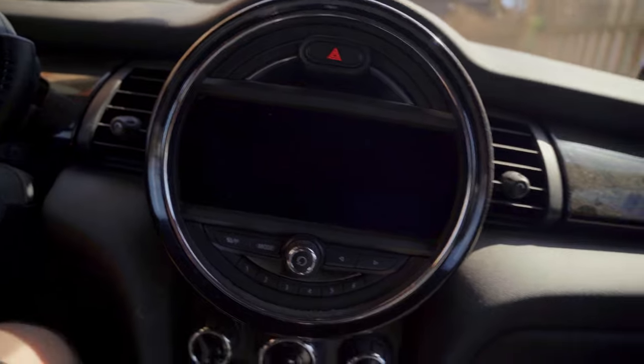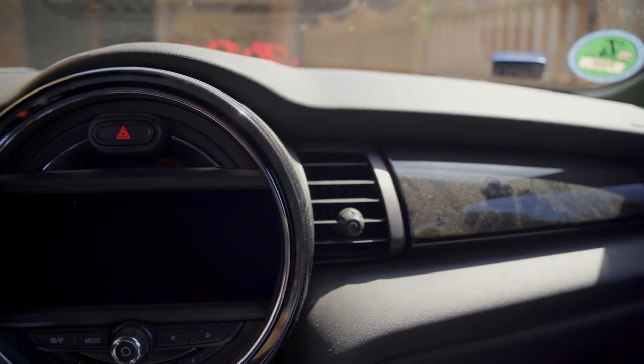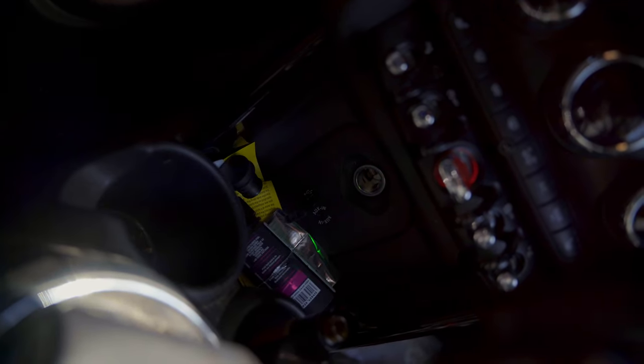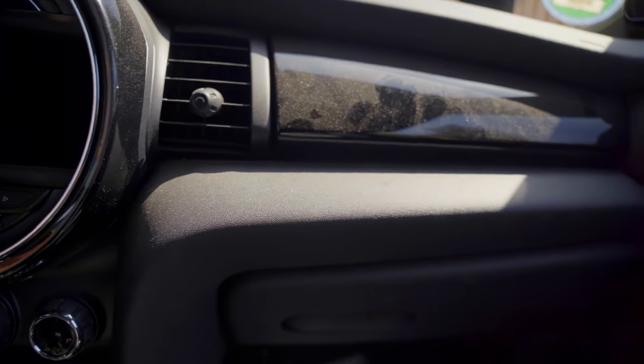Guys, I thought of explaining to you what I meant with this power adapter because down there I don't think, yeah, now it's in focus. This one is a cigarette lighter plug and this can put out 12 volts. With that I'm going to build myself an adapter solution inspired by LeDrip, because I saw in one of his videos that he is doing it with a 12 volt cigarette lighter and an XT60 to charge up his batteries. And this is, I think, the most practical and easy way to get myself a proper charger for my LiPo batteries on the field.